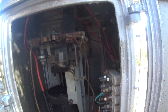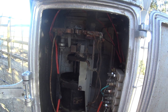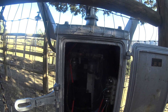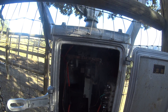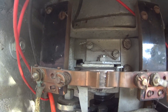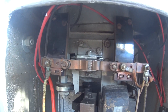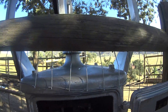When you release power, the counterweight drops and the stop sign turns towards the street. The reason for that is so the stop sign is turned towards the street in case the power went out — at least it's got a stop sign. Even if the lights failed, the stop sign would still work if the power went out. You can see that's power off. Power on pulls it up, the weight drops, and this contact right here activates. So right now there's no power to it, and that's what makes the stop sign turn. Power on pulls it that way, and the lights and bell are of course on the flash circuit.